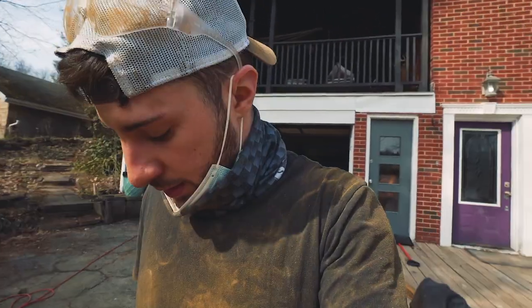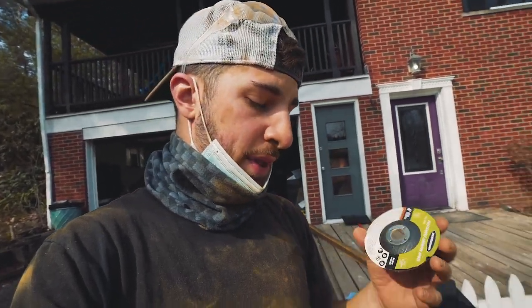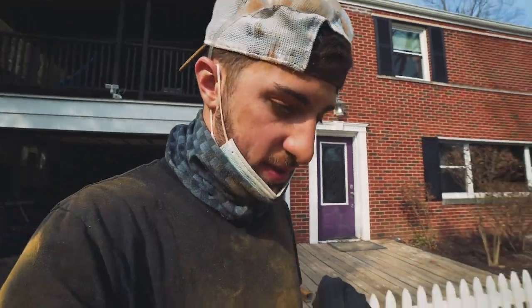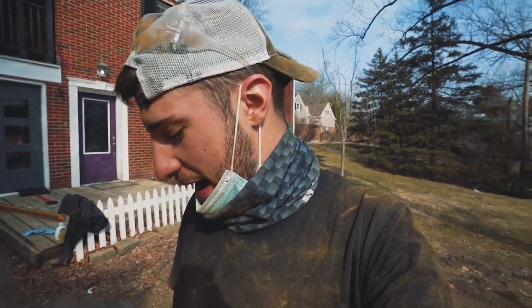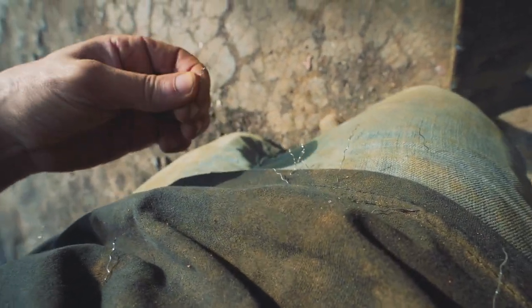It's definitely time consuming if you go about it this way. I ran out of the polycarbide abrasive wheel discs — these are the best way to go for removing paint, although they're about five bucks each and only last about half an hour. They're still better than a wire brush. I ended up buying everything Harbor Freight had. The wire brush worked but took much longer and sent shrapnel everywhere — I literally felt like I was getting hit by arrows. These wire bristles will shoot into your skin and it does not feel good.